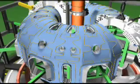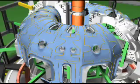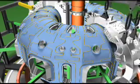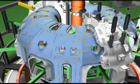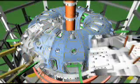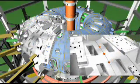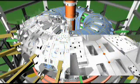The 2nd to the 15th TF magnets are rotated to the position in a toroidal direction, just like the process of the first magnet. The rotational direction progresses in zigzags. Between two neighboring magnets, various shear keys or conical bolts are manufactured by on-site fitting and then installed.